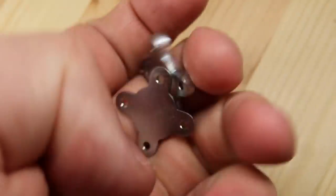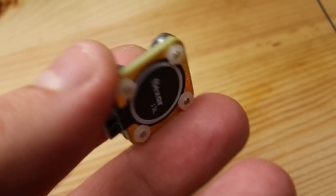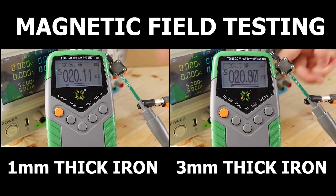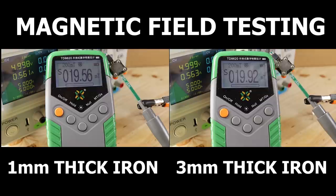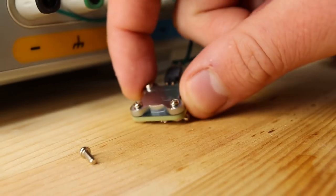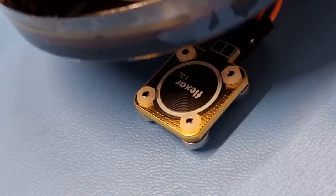Like I said in my previous videos, the magnetic field of these PCB electromagnets can be improved by adding a piece of steel or iron at the back. I have custom made these iron samples at PCBWay which are 1 and 3 mm thick. Both improved significantly, but the thicker version had a slightly higher result. This combination can be used to attract light pieces of metal or even ferrofluid.